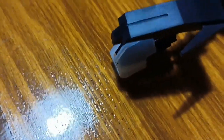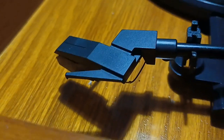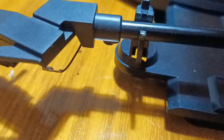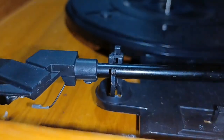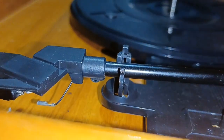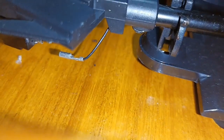Red and white, and now I've just got to lift it up, angle it, and clip it back on to the headshell. To put it back in, you've got to put the rear in first and then the front up, and it just clips in. Having successfully clipped it in, you can see here what the problem is — the black wire has fallen off one of the pins and I'm going to have to try and reattach that. This is where it starts to get a bit fun because that wood lip is still in the way.